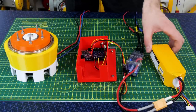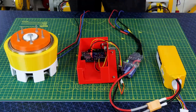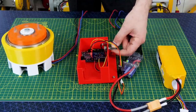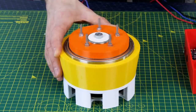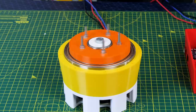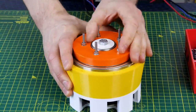For basic testing I'm just using the same old LiPo that's got tons of juice, a VESC which is actually meant for skateboards, and an Arduino in a box so I can feed it with a signal. That seems to run the motor perfectly well and everything seems to run really smoothly and it sounds pretty good as well. This time however I can actually stall the motor with my hand, which I couldn't do with the cycloidal drive, although I'd imagine there's already more friction on the motor here due to having to deform that flex spline. If I try to back drive everything it is extremely hard — I can move it a tiny amount in one direction but nothing like the cycloidal drive.